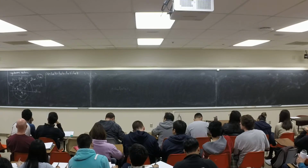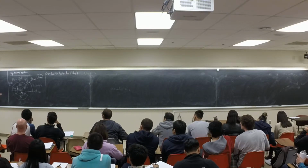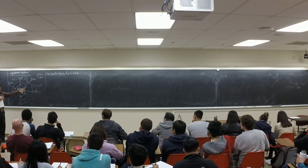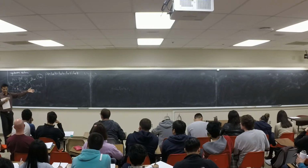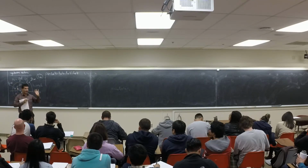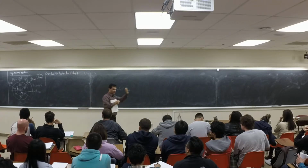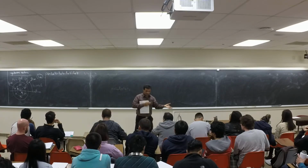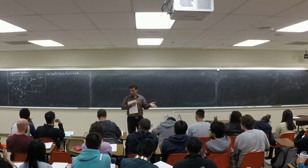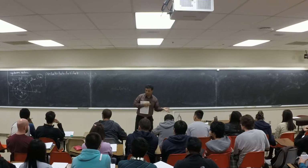Why? I want to calculate the voltage across the machine, right? Inside the machine. What's the voltage of phase A inside the machine? Whenever we have a motor or generator, we have a terminal voltage which we connect to it, and we have back EMF inside the machine. What's that back EMF? That's a voltage, right? It's d lambda over dt. D lambda over dt is a voltage.